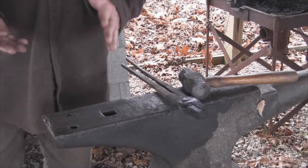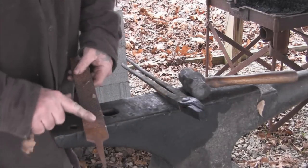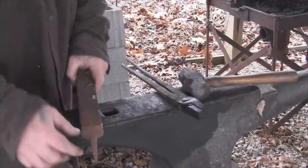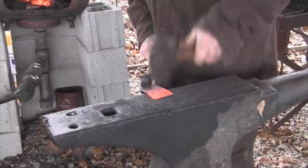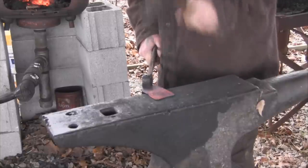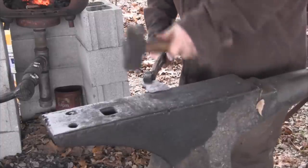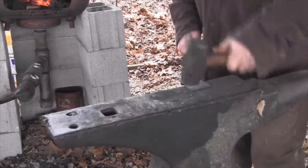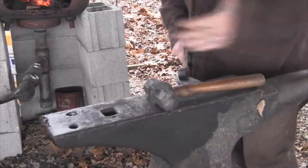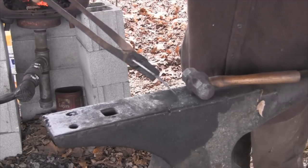We're going to make two of these — we're going to curve one when we're done and leave the other one flat. We're going to use another old horseshoe rasp with a slightly different configuration, a little bit longer tang, but it'll work just fine. All I want to do is get a good bevel on this one edge. Once it cools down we're going to grind it off anyway, but I want it pretty well shaped to begin with.